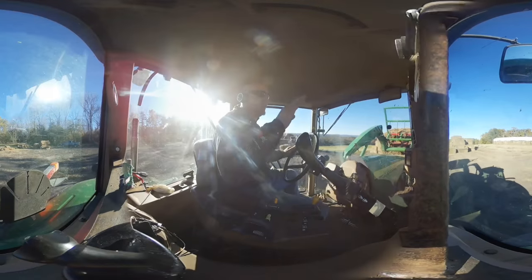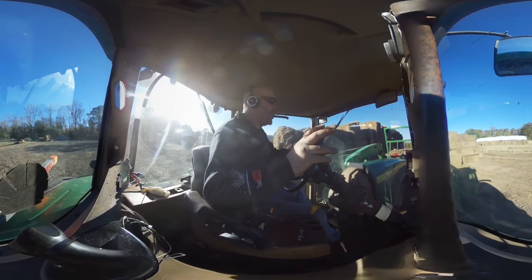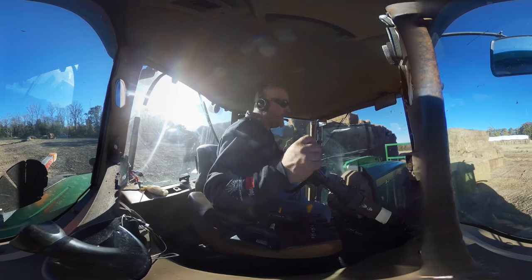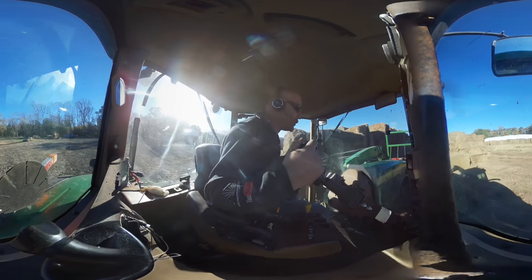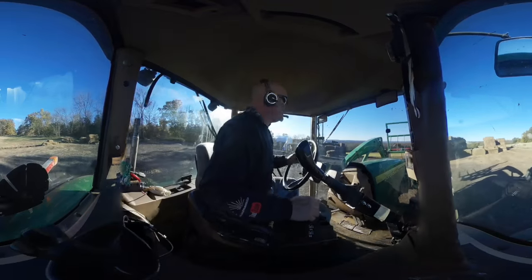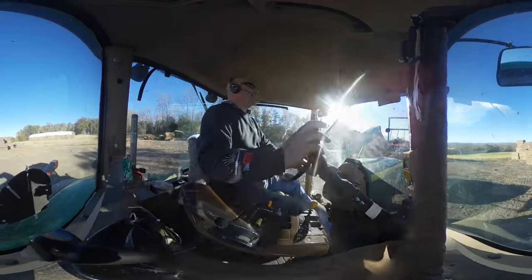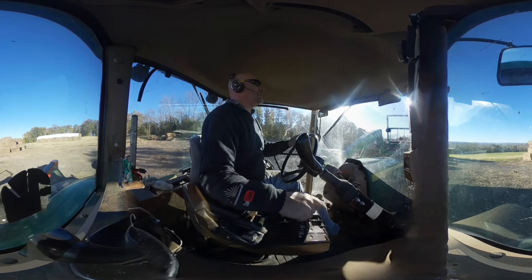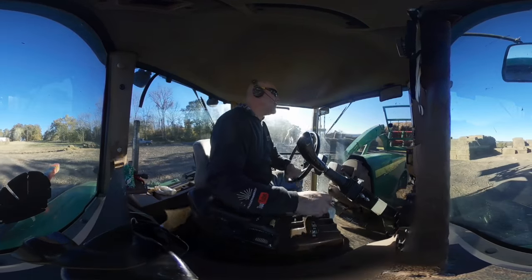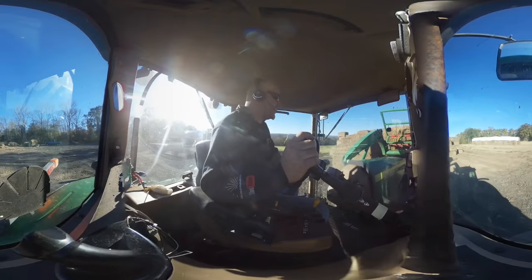You know, you're going across a field and the spikes are flopping around up and down like that. And when you're hauling as many bales as I am, you're putting too many bales on the loader. Like two of these 4x4s and three of the 3x4s. And there's a lot of leverage out there, you know. It's okay. It works. It does its job. I'm happy with that. But I disengaged it. All I did was made a couple of clamps and clamped it so that it won't flop up and down. Works just as good. Actually, it works a lot better.